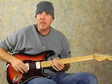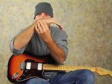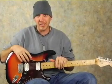So think of the inside of this potentiometer as like a horseshoe. And then there's a wiper that, as you turn the knob, goes around a horseshoe of resistant material. So little dust and dirt gets in there, and every time you're swiping over it, you hear that crackliness. And I'm going to show you how to fix it really easy, okay?